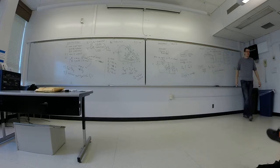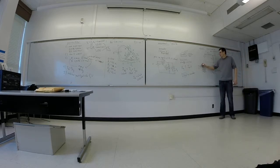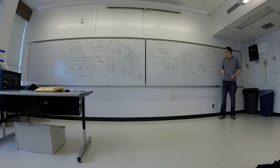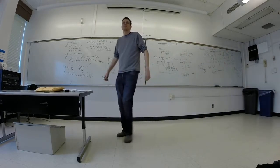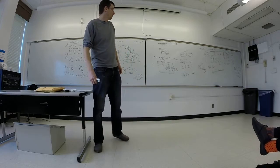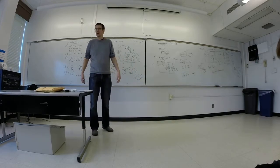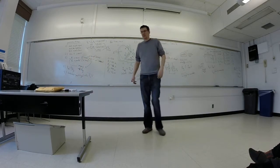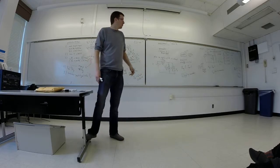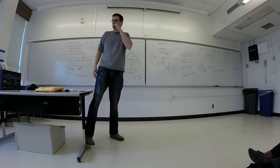Now, having a high resistance is a lot easier. A typical voltmeter might have resistance in the mega ohm range. So that's a lot of resistance. Unless the resistors you're measuring are also mega ohms, then it's a big, big wrecking ball. So this is something to know. None of you guys are obviously going to become electrical engineers, but the measurement device is only as good as its limitations, right?